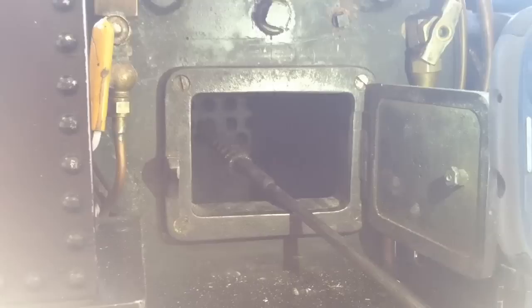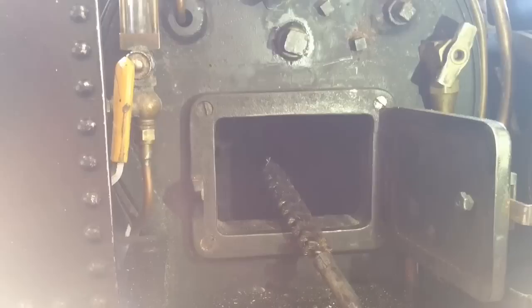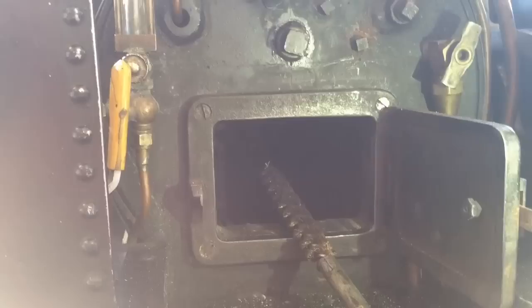As you can see, there's a series of flues inside the locomotive and each one needs to be individually cleaned with this brass brush. When choosing a brush to clean out your flues, it's best to get one that's slightly oversized — that way you get a nice, good clean. The chance of eroding the flues from running the brush through is very little, as the copper is fairly strong. If you keep them clean, they should last you for several years.